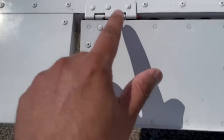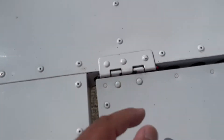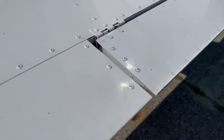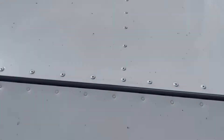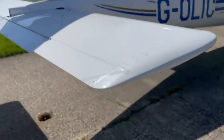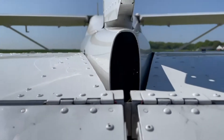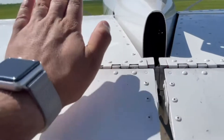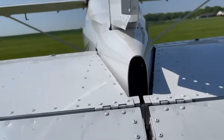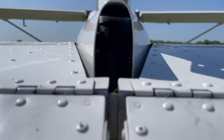Checking out the elevator — it's very similar to the wings. You can see that red paint again, which is just showing me that everything is in line. I'm also making sure that that little metal bar is holding the trim elevator in place, that it's not broken and is fixed exactly where it needs to be. Coming around to this side as well — everything seems to be how it should be. Looking inside — you probably can't see it very well in the video — but there is linkage between them, so when you press the left or right rudder, that actually moves the rudder at the back. I'm just checking the linkage to confirm it's all there, and yes, I can confirm it's absolutely safe.